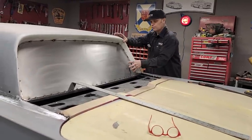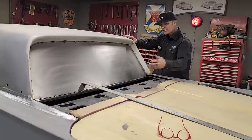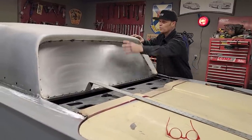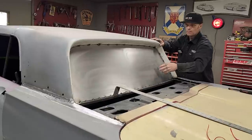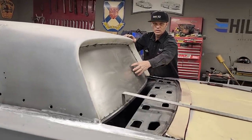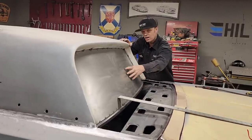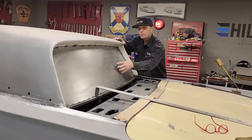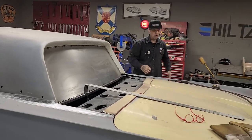With the window — I was looking at Jolene's phone and it said 'you wasted a lot of metal there.' No. Basically, if you're going to replace the window, you want to cover the whole window, and then when you get the window cut out that's when you cut your shape. You would never want to try to cut the outer edge and then plop a window in the middle of it. Trace your piece, then cut your window out, then put your window in. And the metal that comes out from the window — we would never throw that away. That just goes down to the other end for smaller stuff. No waste.